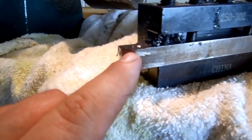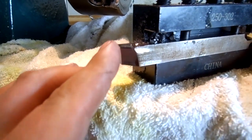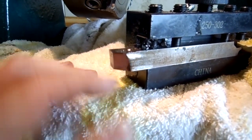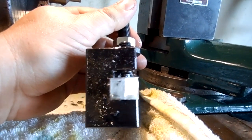So we've got a 45 degree roughing edge, a 10 degree finishing point, a negative 5 degree relief, and the front relief is roughly 6 to 8 degrees. The top or side rake is about 6 to 8 degrees as well.